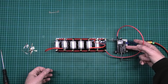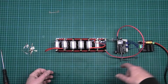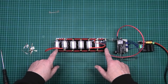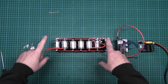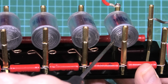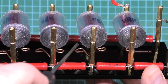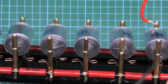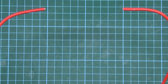To make this easy so people can understand: the transformer — this is literally a transformer — it converts whatever voltage input you've got to 20,000 volts output, which goes through this wire, and this is the ground. What it does through the capacitors is it charges this rail as negative and it charges that rail as positive. And then with the spark gap — the first spark gap here — when it generates enough voltage for it to jump that spark gap, it then puts these into series and then it jumps over to there and puts those into series, and so on. Until you have a multiple of all those in series, and that's the voltage output you get, and that's when it starts bridging that.